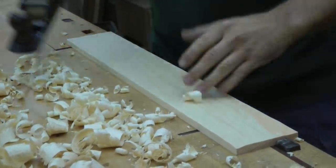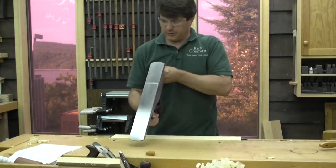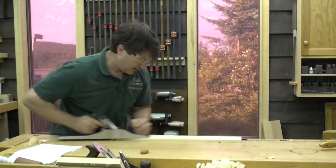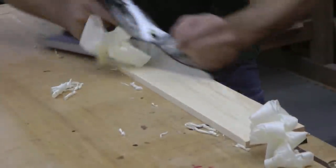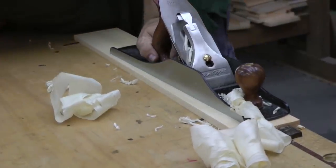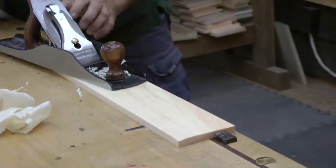I just love the way this stuff cuts. I'm going to finish that with my bench plane. I was using this earlier today so I may need to put a new edge on it. Keep that well lubricated. Blade out fairly heavy at first, so we get rid of those surface imperfections left by the scrub plane. Sixteenth of an inch on this side — thin here, thick here. A little heavy in this corner, a little light in this corner.